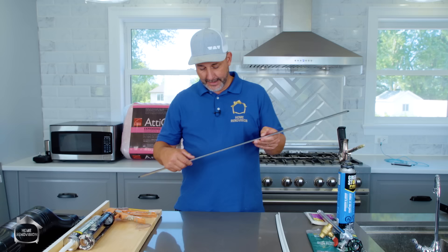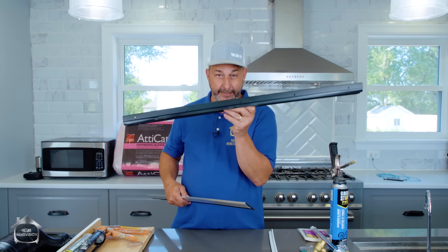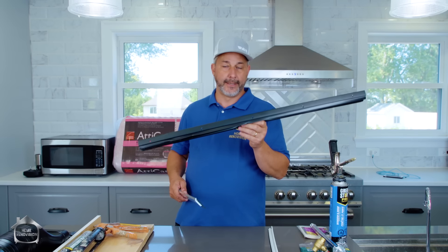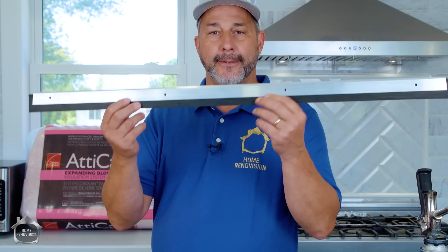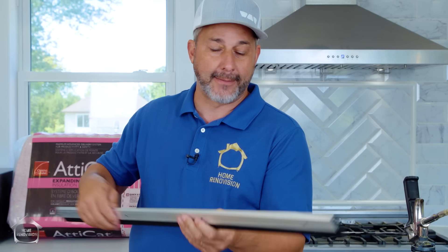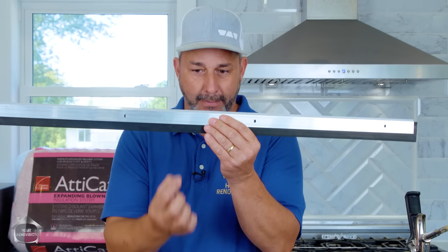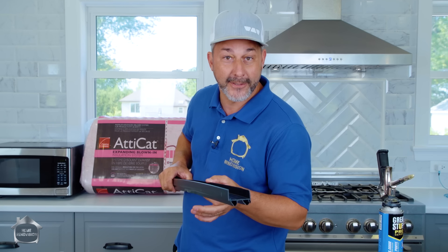If your door is too close to the bottom you'll rub the fins right off and they become useless. You might need to make a minor adjustment to your door if you have an old wooden one, but if you have a brand new or relatively new door bought in the frame and jamb, this will work fine. Here's another option — this door sweep covers gaps up to three quarters of an inch, which is standard. If you have an old door or a wooden door, or somebody put a commercial door on your residence, you can buy one that goes up to inch and a quarter, screws on the bottom, and has a thick piece of rubber to close up the air gap.